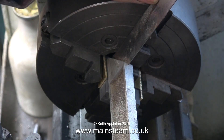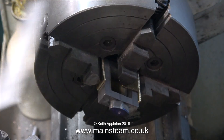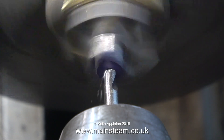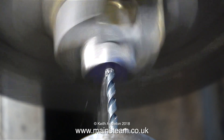I've refitted the four-jaw chuck into the Boxford lathe and I'm using it to hold the steam chest in position so I can drill the end of it. I've used a 90-degree square to verify that the part is at 90 degrees to the chuck — this is a precision item. Not only does the hole need to be exactly in the center, it needs to be perfectly aligned with the steam chest.